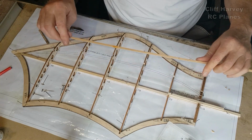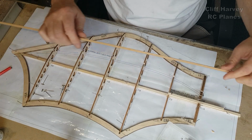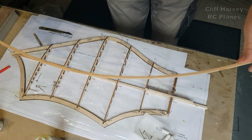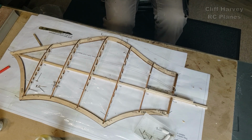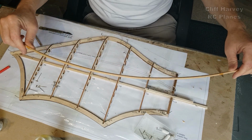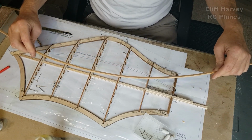I'm just going to pop into the kitchen. I'm just going to hold this over the steam for a couple of minutes just to put a curve in it. So curve it more than you need to in the steam. Just hold it for just a minute. I mean, that's a much bigger curve than I need, but when I let go, it's going to spring back slightly.